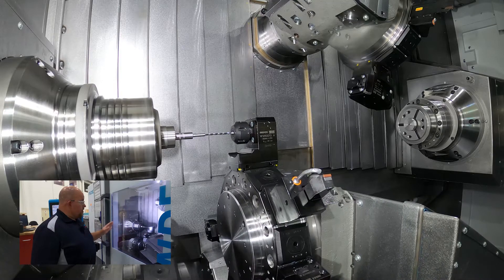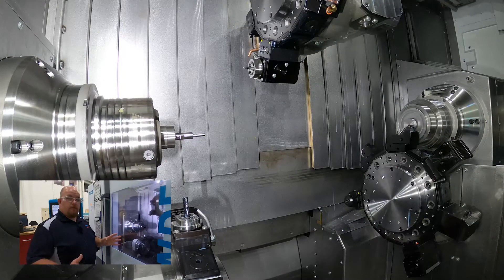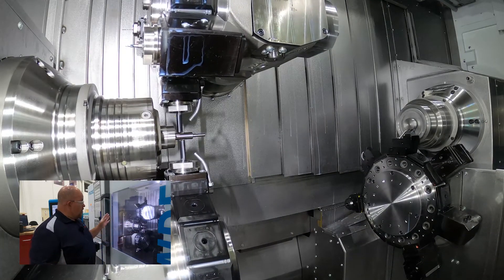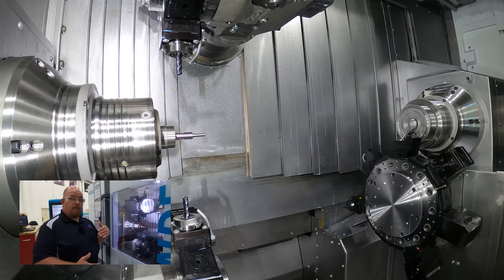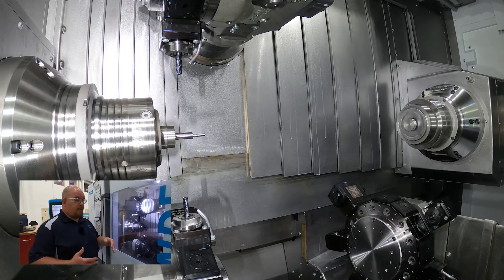We're sending that deep into the part and we're using channel three because of the length of the tool so that we can index it around — that's why we brought it over to work on the main spindle. And here you see some more synced up action in the axes — we've synced up the 10 millimeter end mills for the flats so they're cutting that time right in half.